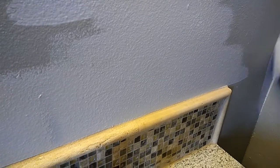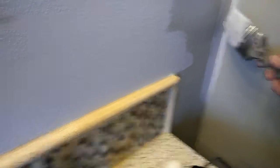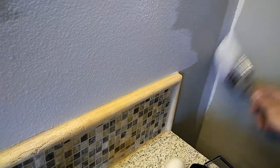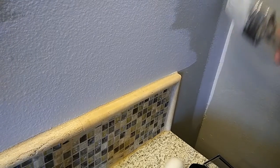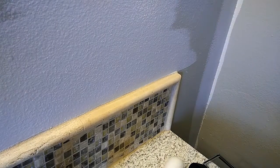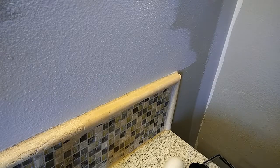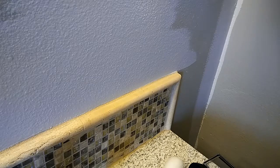Here's your corners. People say you've got to do it all this one way - no, you go like this too, in the other direction. That gives you a nice feathered edge and then you don't need to use a roller. I watched a guy using rollers to cut in and I was like, where'd you learn that? If the people I worked with years ago, my old bosses, were still alive they'd roll over in their grave just seeing you do that stuff.